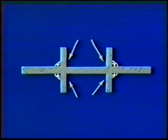For additional practice, weld the five-plate assembly as outlined in previous T-joint practices and then call your instructor to inspect the welds.